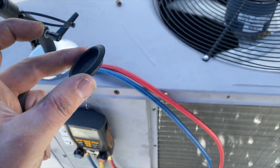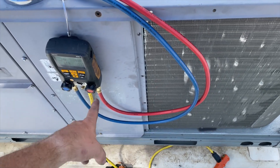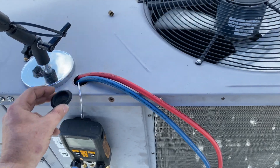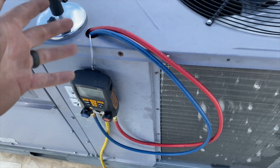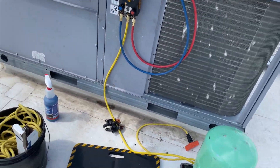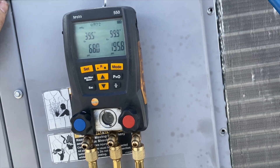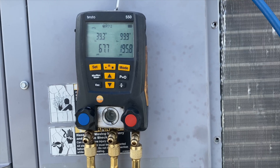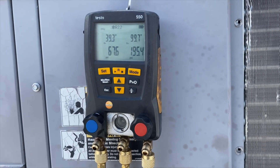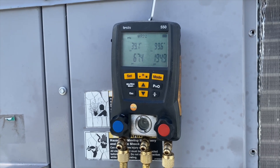There's a nice feature on this unit — a little plug hole — so that when you have the panel off, your hoses can come out through it to bypass the coil. They put this hole so you can put your hoses through it, and when you're done you just plug it up. I ended up charging the two extra pounds needed to reach the full 5.2 pound charge.